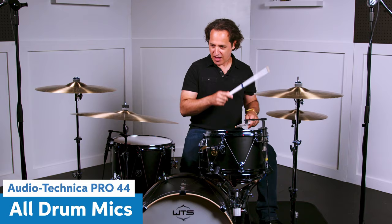The mic you're hearing me talk through right now is the Crown PCC160. This is an industry standard stage floor microphone. Tackles up to 120 SPL without breaking a sweat. It has a three-position bass tilt switch, which fine-tunes the mic's low-end response for any source or application. The electret condenser capsule provides a wide, smooth frequency response from 50 hertz to 18 kilohertz.